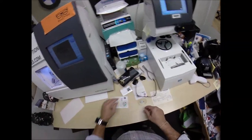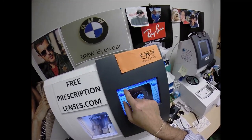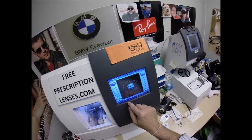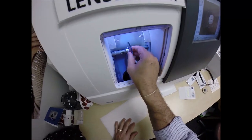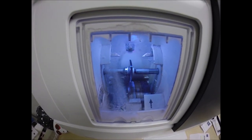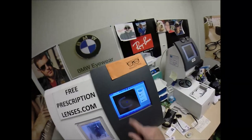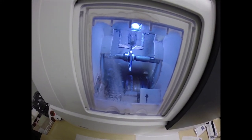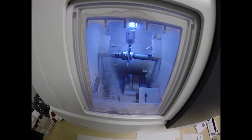This is June's first pair of glasses, so we're going to make sure everything is perfect. These are polycarbonate lenses — job ID number 2229. The magnet goes into the chuck, or as I like to call it, the Charles. The door closes, the clamp shuts, and the lens is going to be traced by the two white styluses to make sure it's large enough to fit into the frame. Like the old carpenter says: measure twice, cut once — measuring the thickness of the lens at every point to know exactly where to place the bevel.